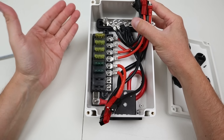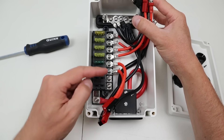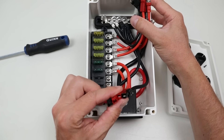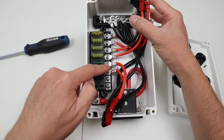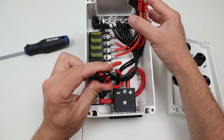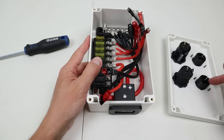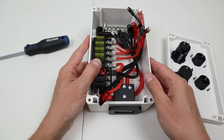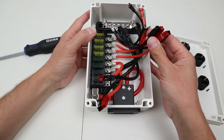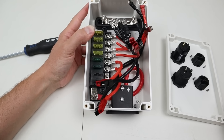I've finished the final Anderson PowerPole connections. For these I wanted 30-amp connections, so I'm using 10-gauge wire and 30-amp fuses — basically the same setup but with heavier-gauge wire. I have two positives coming to these and two negatives, cut to the proper length with the same orientation. These go in and plug into the Anderson PowerPole connections, secured with a screw. It is organized but very tight — I don't know if you'd fit much more wire in here.